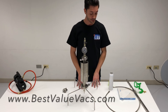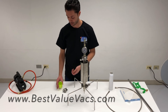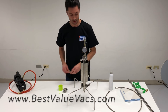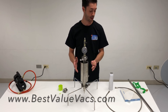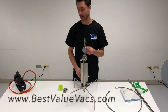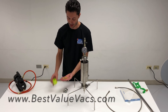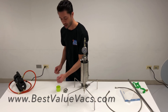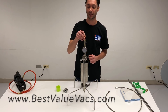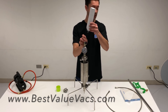Next, start adding your solvent. The material column is super frosty and the material inside is very cold. Grab a can tip adapter — these come with the solvent cans. Choose the one that most appropriately fits the inside of the flare at the top, insert your can, and put your solvent in.